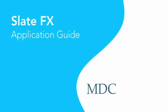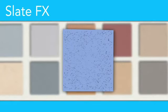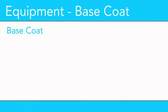The following video will cover the basic techniques required to successfully install MDC's Slate FX. MDC Slate FX is composed of both a base and effect coat. The base coat provides a color, and the effect coat is a clear coat that has a fleck suspended in it. The base coat can be applied by either spray or rolling.